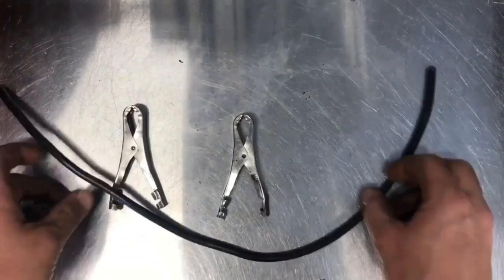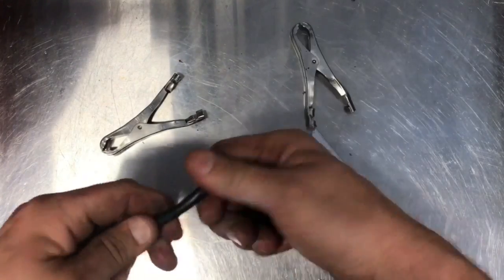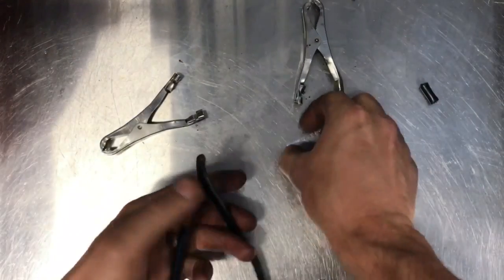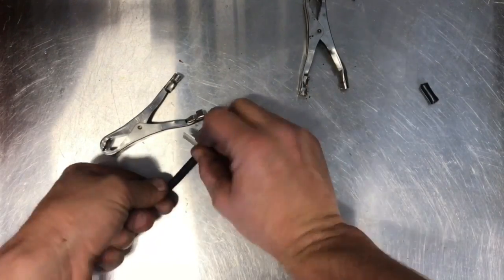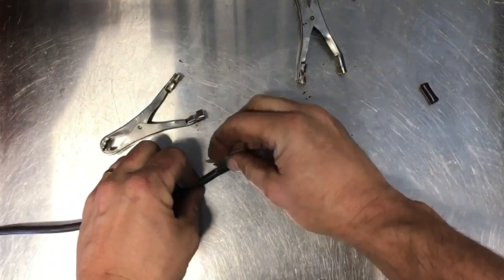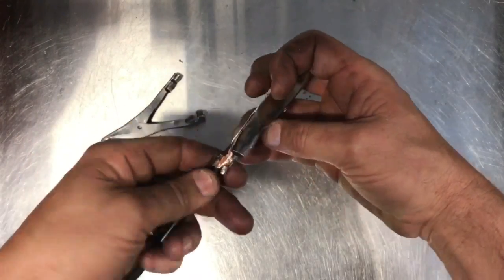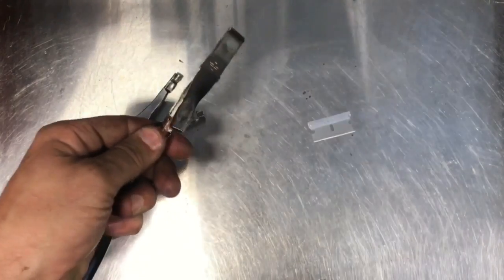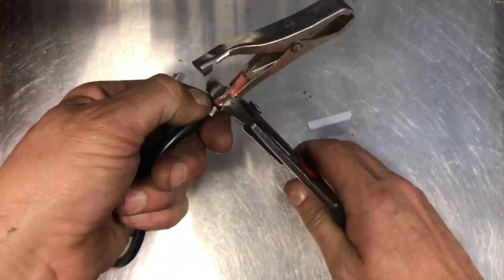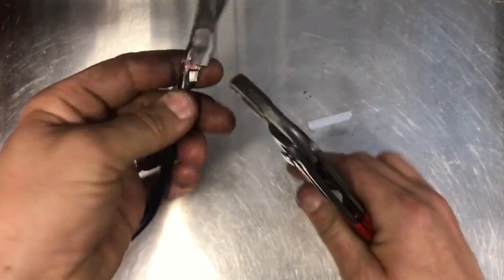You can find these items at a local parts house, or if you're like me, out in the garage with all your junk. What you're going to need is some large gauge wire and two heavier clamps. We are checking the amperage that comes off of the alternator and goes into the battery, so that is some high amperage. We've got to make sure we have a larger gauge wire to carry that current so we don't burn up any wires. The wire I found comes off a really crappy set of jumper cables — you know, the kind your grandma gets you at Christmas. I never used them, so I decided to put them to good use.